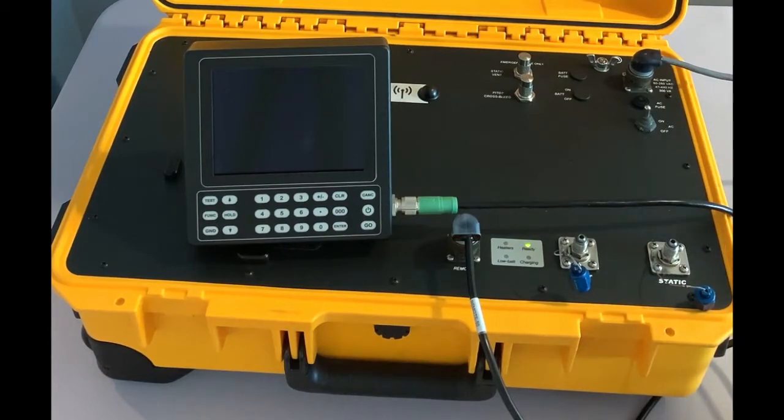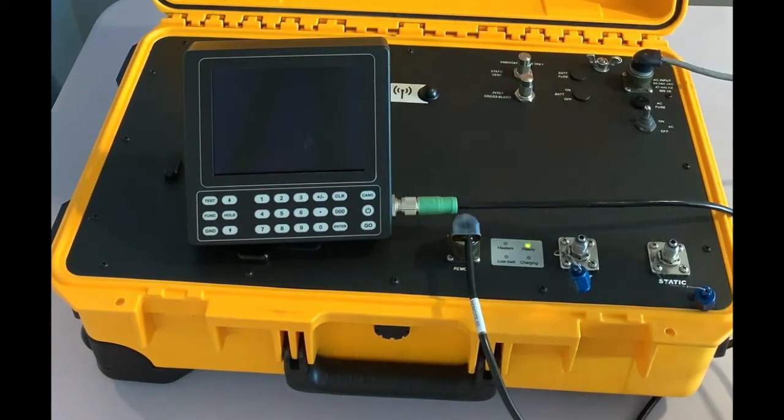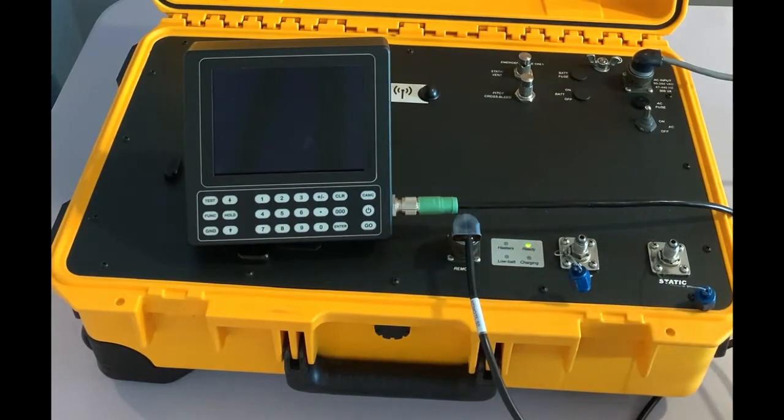in an emergency mode. To do that, you will open the pitot crossbleed first, gently, and monitor on your analog gauges in your aircraft the airspeed going back down at a reasonable rate. When the airspeed is back down to 0, you will be able to open the static vent and finally bring your aircraft to the ground by reducing the altitude down to 0. Make sure to have a rate that is within range of your aircraft abilities, usually between 2,000 and 6,000 feet per minute.